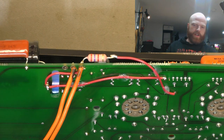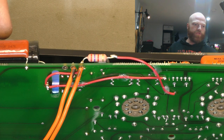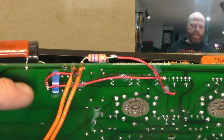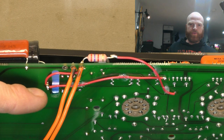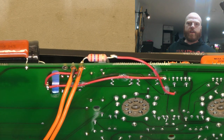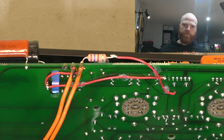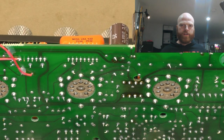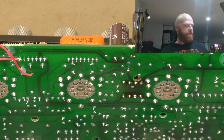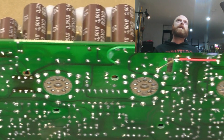I've got the lead from the replacement 33 microfarad 500 volt cap for the B node. The lead extends like the others through the board and then works like a turret, and I was able to wrap some wires around that and then access where the traces used to go. So working our way over, that's the new diodes that I showed you in the previous clip for the low voltage supply forming a bridge rectifier.